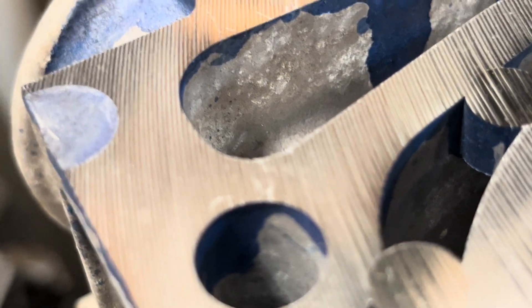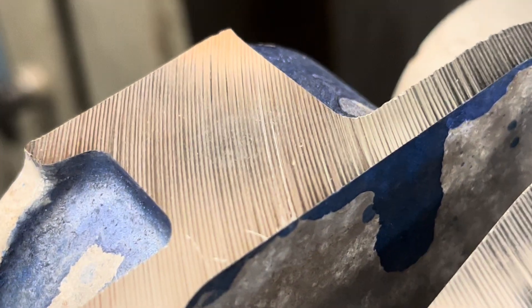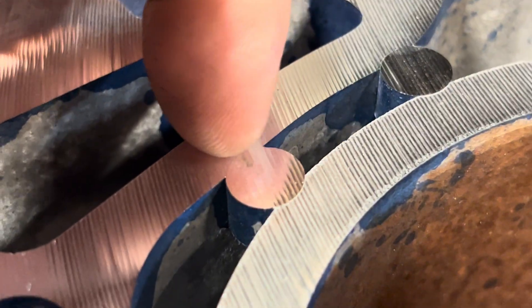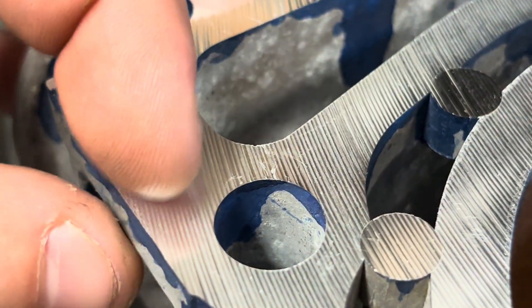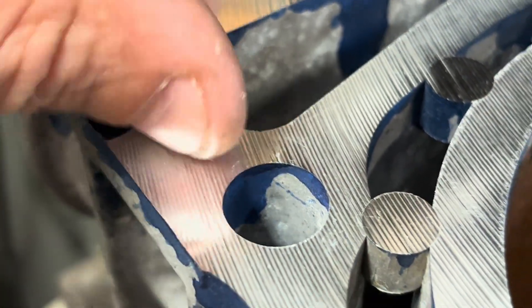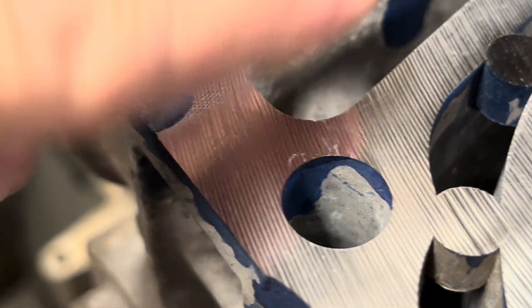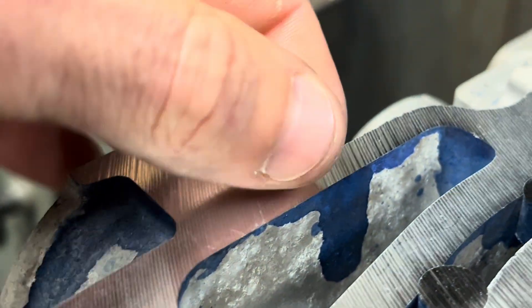See how shiny we got because we actually took a chip. When you take a chip you don't rub and you're going to get a clean cut. I don't know if you can hear that, but if you put a roughness tester on this — it's bad in my opinion. You can see it's not even — taking my fingernail — that would leak here for sure.